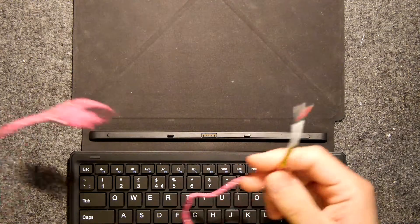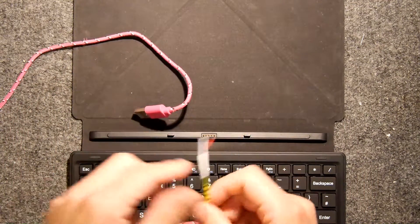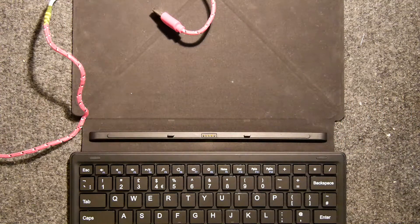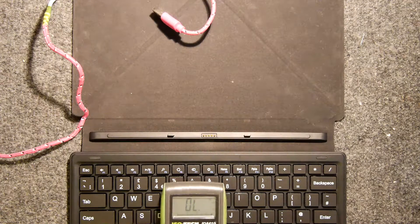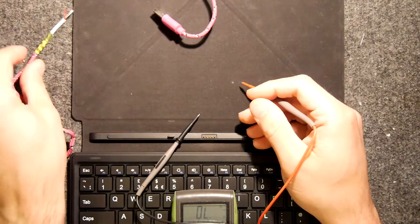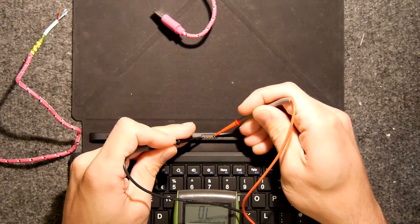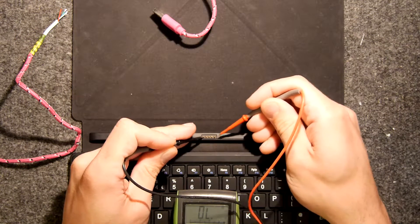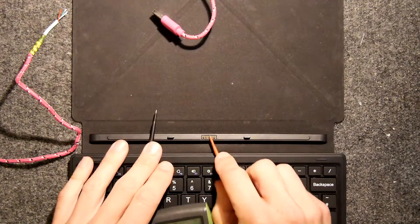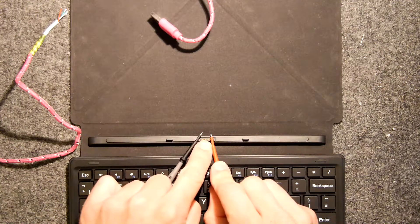I thought for a bit of fun I'll take this USB wire, which I actually damaged before doing a sort of strain gauge test, and I'm going to solder some USB onto here and then try plugging it into a PC just to see if I can pick it up. Because I have no idea what these pins are, I'm just going to have to go for a guess. There are too many pins here, which is kind of common because if you use micro USB there is actually an extra pin which is an ID pin. So I'm going to go totally blind and try to work out — these two pins are common, so there's a good likelihood that these two will be ground, and then this will be power, and then the two other pins will be data.